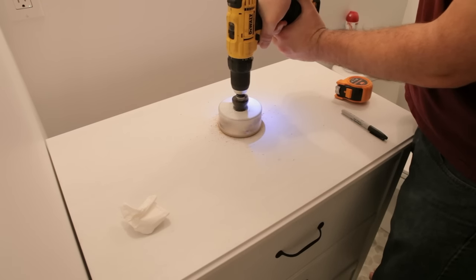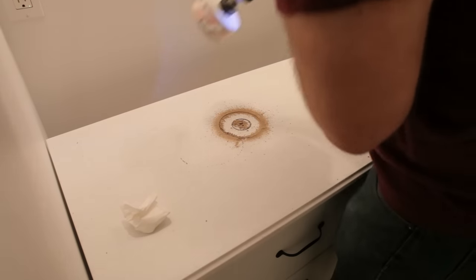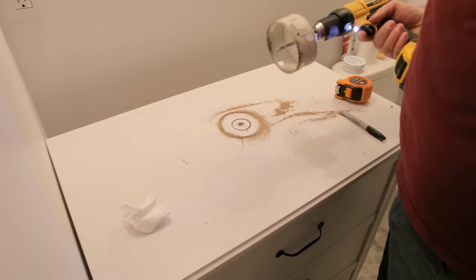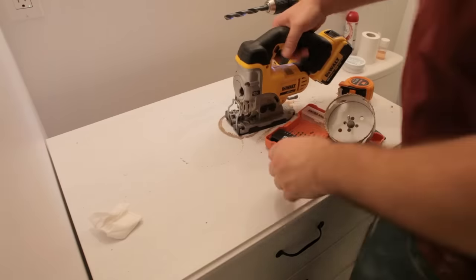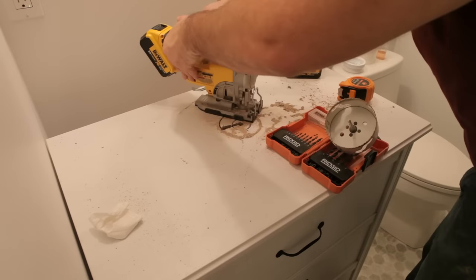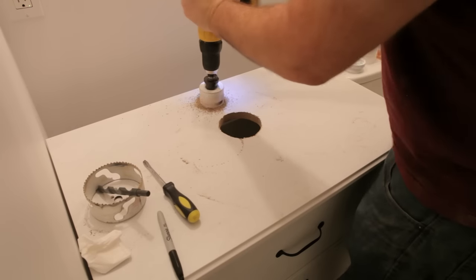I found my four-inch drill bit was actually pretty dull — it should have been cutting through a lot better. I started to press hard on the wood, and you've got to be careful doing that because if you don't pay attention you can bind up and damage other things. I got lucky because that whole area is going to be covered by the sink, but it would have been quite the heartbreaker if I'd damaged the veneer before I even got to use the vanity. At that point I decided to abandon the hole saw and move to the jigsaw, which has nice new blades and took no time to cut along the circle I'd already started. I then used the two-inch hole saw for the second hole, which went in a lot easier and cut through quickly.